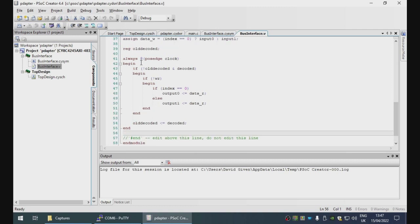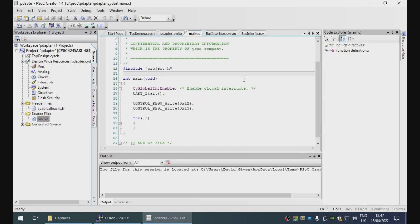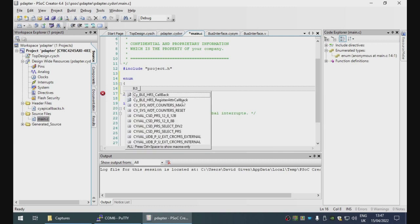Normal UART, if you write to the data register, this triggers a write in the interface because, of course, the interface knows when it's being written to. But the CPU here doesn't, so we're going to have to interlock everything through control bits. Now, we are going to have two state machines for doing the reads and the writes. So let's prepare for this. So this is going to be read state machine. This is for the Brother to be reading stuff from the UART.